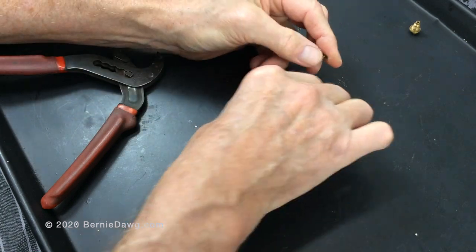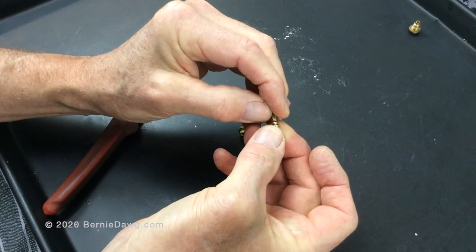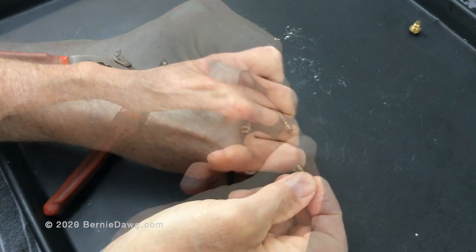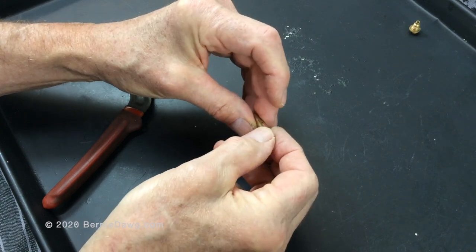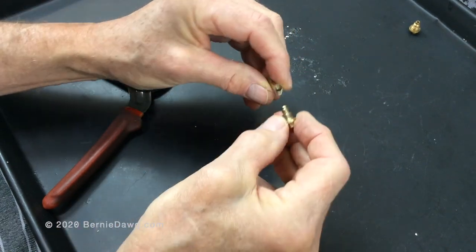Here's the spring, which has been cleaned with a little 4-0 steel wool. Putting the spring back on the pip cup, then inserting it in the NRV barrel, and screwing on the head of the NRV.